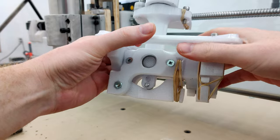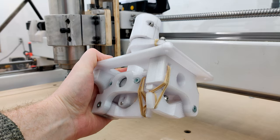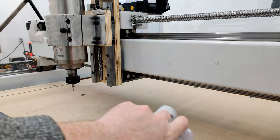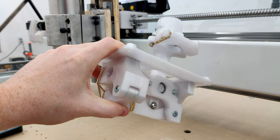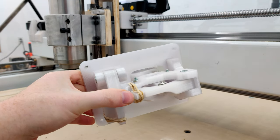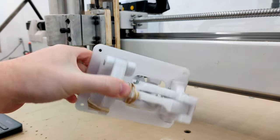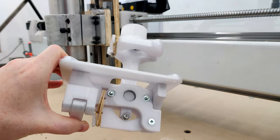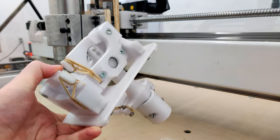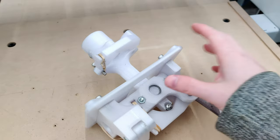This worked pretty good for a prototype, but with 3D printed stuff you're really limited to elastic bands. Trying to 3D print small assemblies that can hold high-weighted springs is very difficult. On a CNC machine in aluminum it'll be a lot easier, so that's where that project stands.